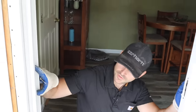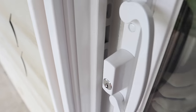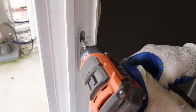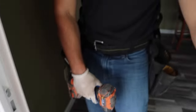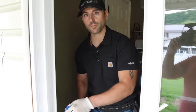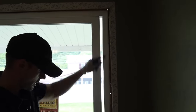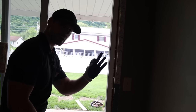Now that all that works, we're going to set this latch side where we need it, then push the frame in to get it plumb and anchor it. Shut the door and see if the latch hooks into this part of the door. If you shut it and it's not catching, clearly it needs to drop lower. We'll try it there and test it — looks like it's catching there really good. So now we're going to take the two screws that came with it and go in each side of this latch. Check this reveal while tightening that up to get it straight from this point to that point. Now we've got a nice straight line and the reveal from the door to the jamb looks nice and straight. So now that we've got it where we want it, put the second screw into the latch.